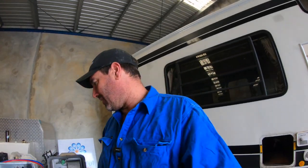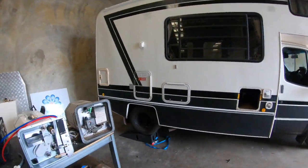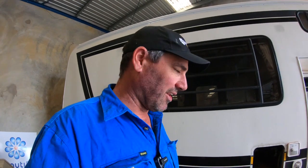So that took a bit of time to find and cut out. We ended up having to put the Winnebago up on ramps on both sides because we couldn't get underneath it - the chassis is too big. We got underneath and cut that line off, sealed it off properly, soldered it so it's not going to leak again, tested it all again, and now it's all fine. So now we can continue on just with the gas side of things.